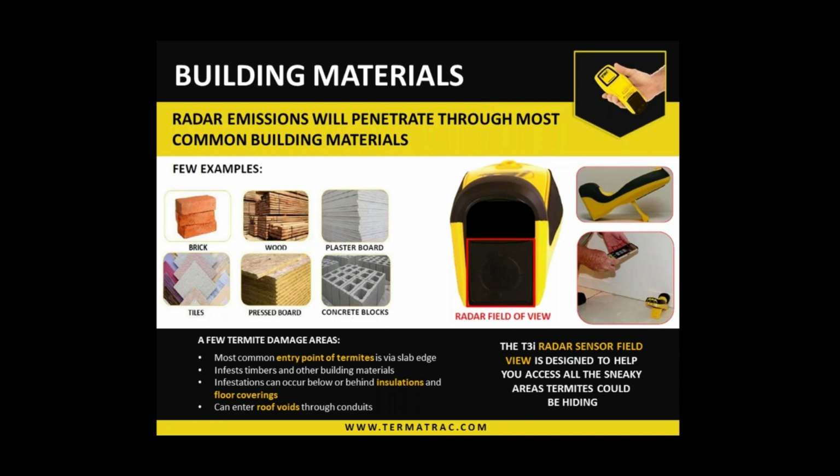So as far as building materials, it does penetrate everything here on the screen. It certainly will penetrate to varying depths and degree, obviously. Now, as far as timber goes, softwood timbers, and the most common framing timber in Australia is a pine, so a softwood, we've been achieving up to 85 millimetres of penetration. As we go up into hardwoods, it certainly does reduce considerably, but we still can achieve around the 40, 45 millimetre depth of penetration in hardwood timbers.